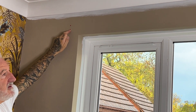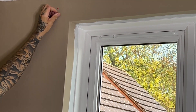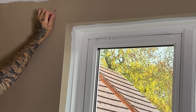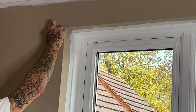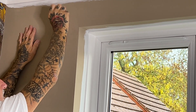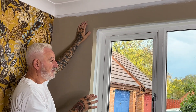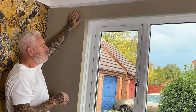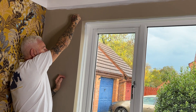The plugs are a little proud — you can feel them through the paper. When the plugs are perfectly flush and you don't think you'd be able to feel them, just put a screw in. People used to use matchsticks years ago, but people don't use matches anymore, they use lighters. So just put one of the screws from your bracket back in, so when you put the paper up this will be here to guide you to where your holes are. I've lost holes for brackets so many times trying to find them after papering, but you normally can because plugs are in the wall. Get your brackets, curtain poles, and blinds down and you're ready to go.